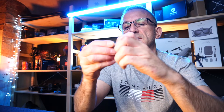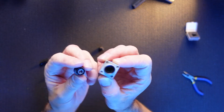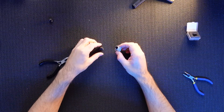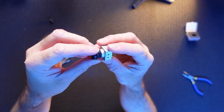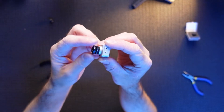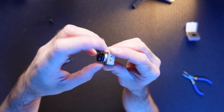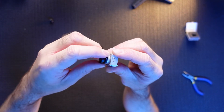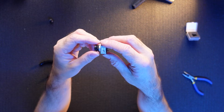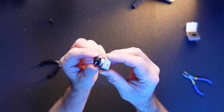Just take the old lens out completely — there's the inside of the actual camera if you're interested. That old lens is absolutely shot, absolutely gone. The new RunCam lens fits absolutely perfect, screws straight in. It does stick out a little bit more than the original DJI lens. Lock it down with the locking nut. One thing you will have to do is reconnect your camera to your air unit or Caddx Vista and slightly adjust the focus to make sure your picture is good before you go out and fly.